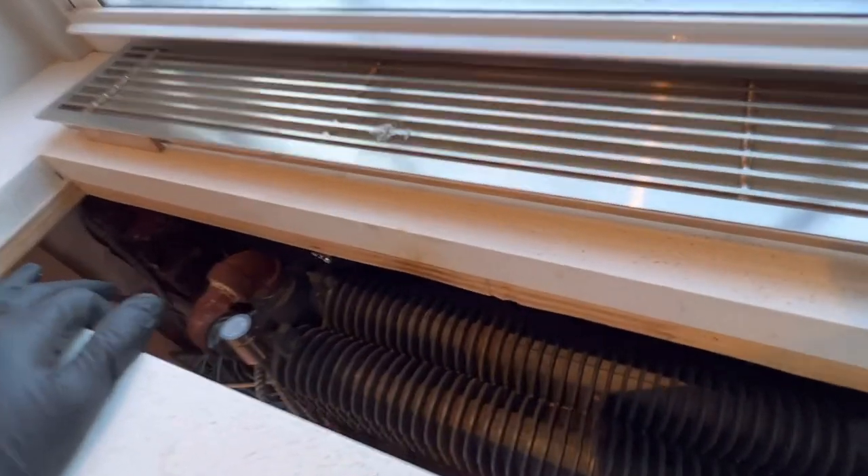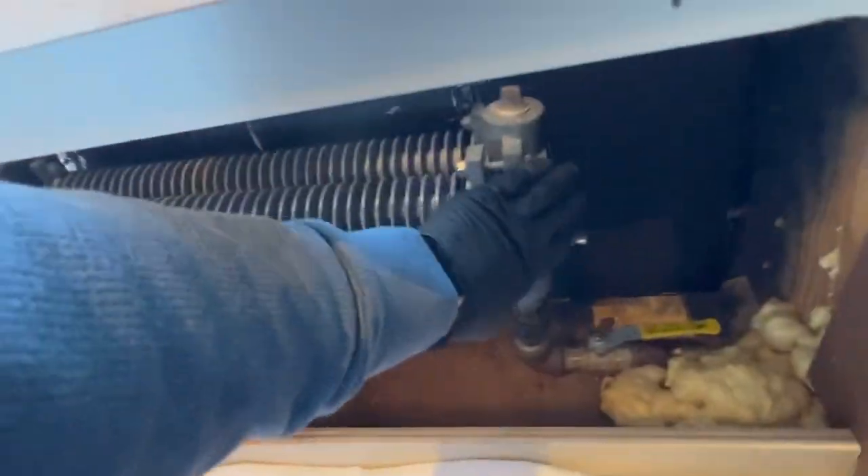It helps regulate the desired temperature in each room for all low-pressure steam systems. The Empire State Building runs on two pounds of steam — we're in a seven-story building so one and a half to two pounds of steam is good enough. It's got phosphor bronze bellows, an O-ring seal, and a seat and poppet at the inlet valve, and it's adjustable. The customer is fed up with the electronic valves, so we're installing Vari valves. 25 minutes later — this puppy is hot. There's the Vari valve right there — hot. You gotta love steam.